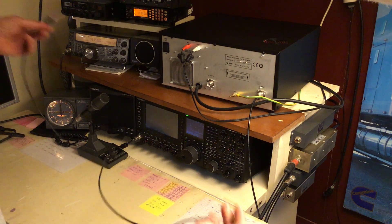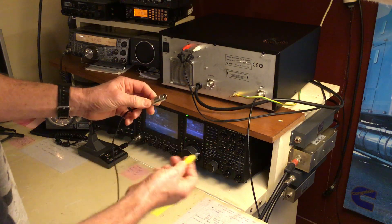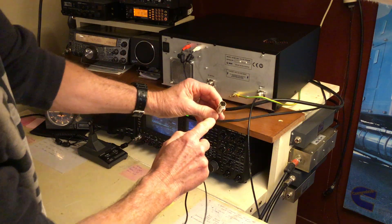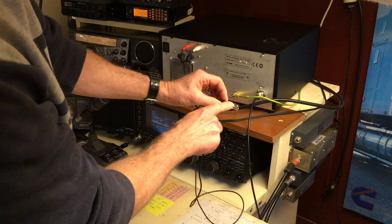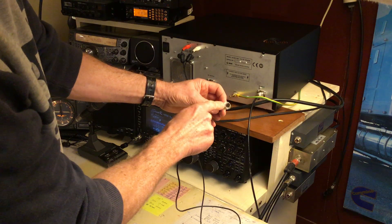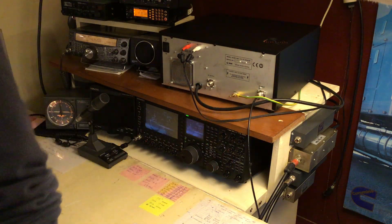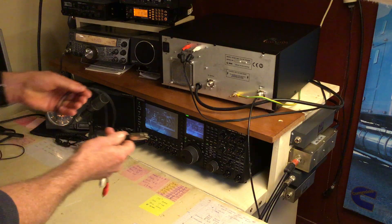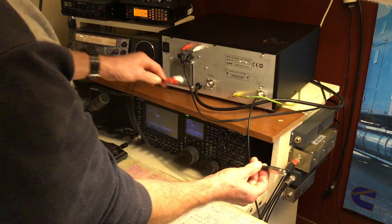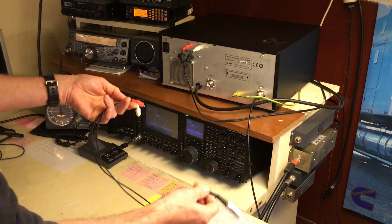I'll show you a couple of pre-made ones I've made. I just made this one for the TS-2000 if I take it out to our other property. Just simple, just as the work is key in only. And these are a 7-pin DIN connector, made here by Jaycar in Australia. Very well made, but you just got to have a steady hand so you don't melt the inside of the plastic with your soldering iron. That's the normal full size one, and you can make it any length you want. This shorter one goes straight from the back of the radio into the amplifier.